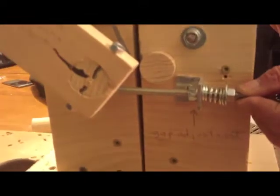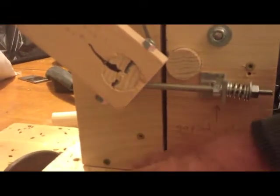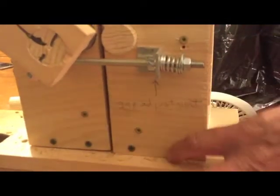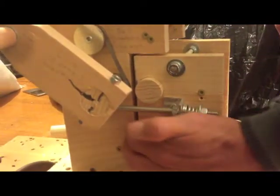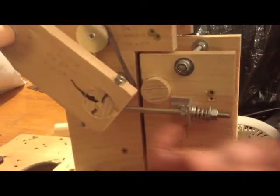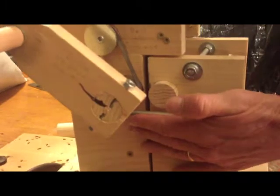You'll notice over here what we did was we took a 5/16th threaded rod. We've attached it on the side that's not attached to our base plate. On this side, all of this is attached here. So we can use this set screw to adjust our gap. At all times this is always pulling it in, but if too much rice gets in, it'll let it flex open a little bit.